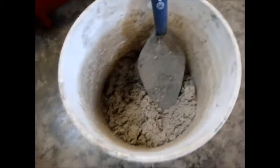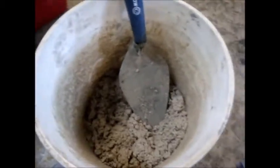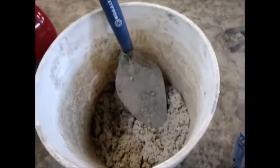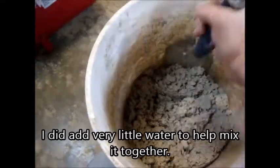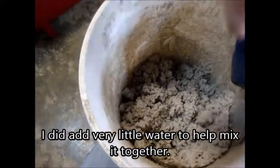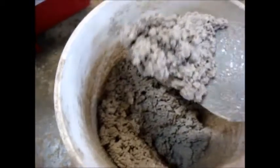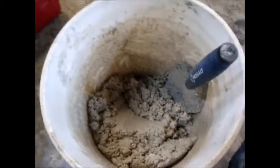That is a half gallon of refractory and all eight quarts of the perlite. This was very difficult to mix by hand — I'd probably suggest having some kind of a paint stirrer on a drill or something to help mix this up. But there's our mortar mix, going to end up laying nice. Alright, time to put it in.